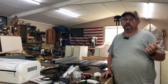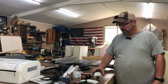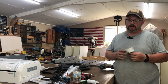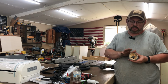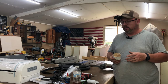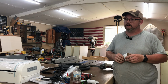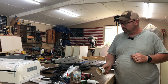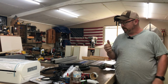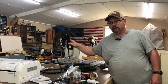So we're on day two today. Unfortunately, it took a little longer yesterday than I had planned. First problem being our hole saw. I did not have the correct adapter to go in here to mount a drill bit. I tried to make one work, that didn't work out. So I ended up taking a jigsaw outside, cutting the hole, and it was not the prettiest thing. It's one reason I didn't record it, but I did get the outdoor unit hung, the hole in the wall. So today we're going to go ahead and hook up the lines and the communication wire.